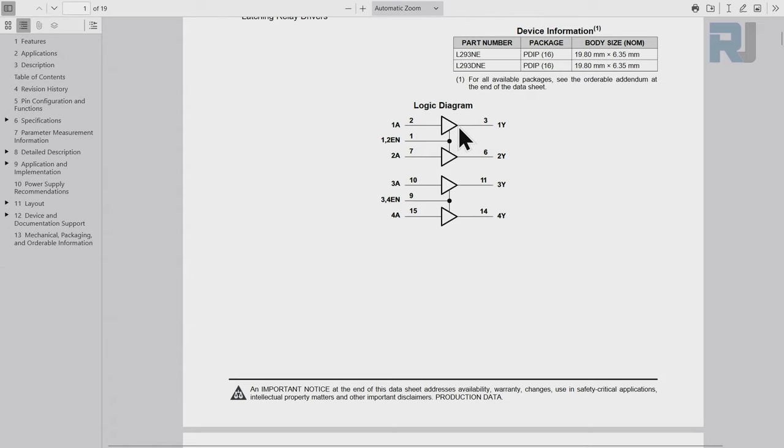First we define pin 13 and 14 for the motor - Motor 1A and Motor 2A. We use the word 'define' which means they are constants and cannot change. Inside the setup we define those two pins as output using pinMode. These lines run only once because they're inside setup. Then we come to the loop function.